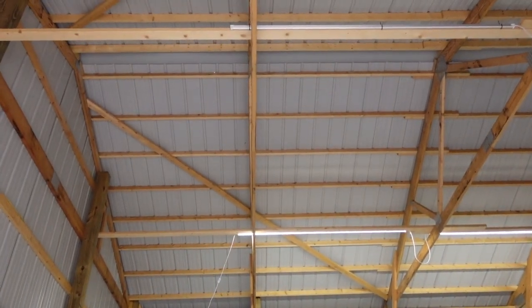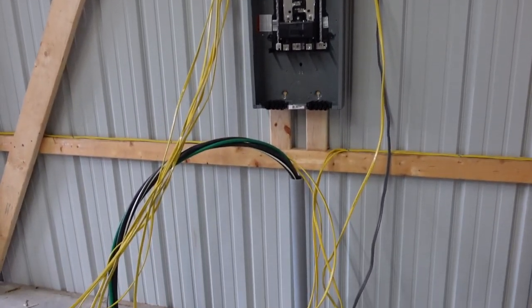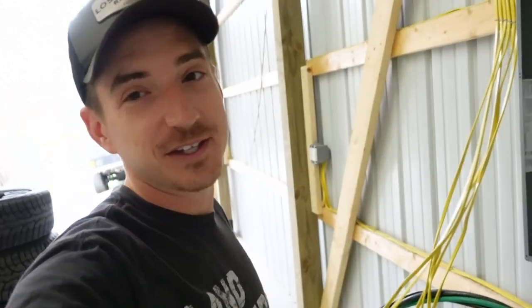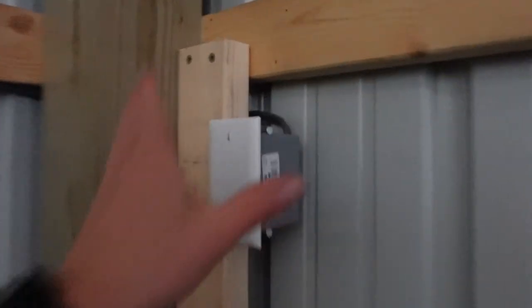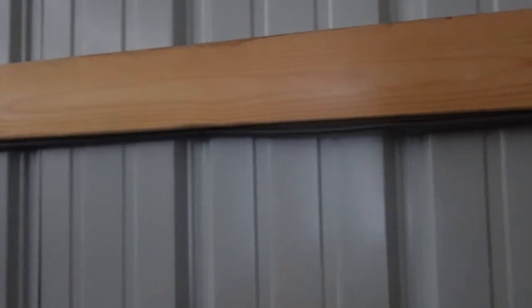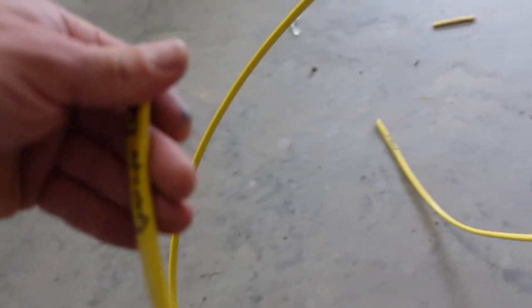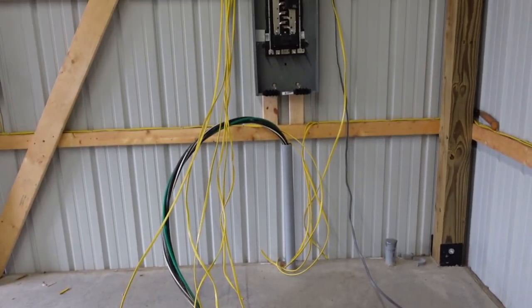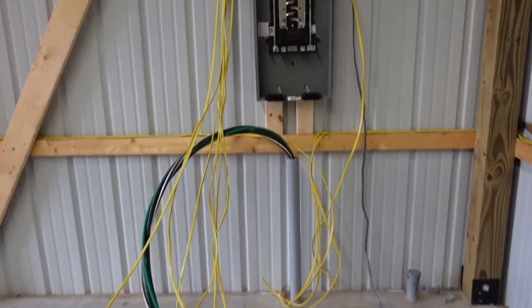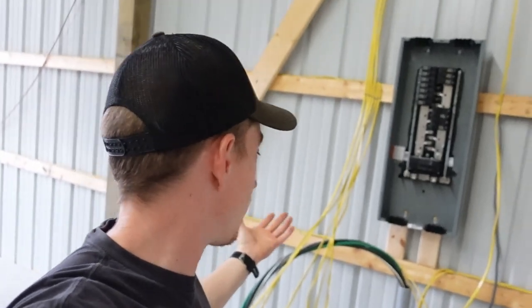Working our way through, not looking like a junkyard around here. We'll get the camper in here to stand on and plug that light back in, but for the time being you'll just have to deal with my mood lighting. There is exactly 1,000 feet of 12-2 in the shop — I guess this is the only point in time I'm happy I didn't build a bigger one. We also went ahead and wired up our air compressor outlet — the air compressor will be hardwired into this box. We have our 10-gauge ran all the way across and back over to the panel, and to keep everything straight I have the ends of each run labeled with a sharpie. We'll probably waste a foot or two on each run feeding it through into where it needs to be, but I'd rather do that than have an 80-foot run be six inches short.